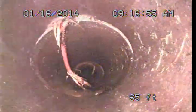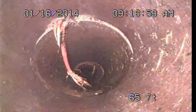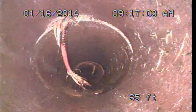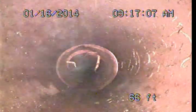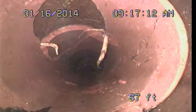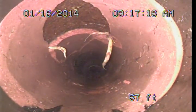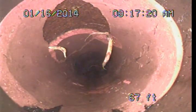We are seeing some remnant roots left, some that were fairly large in diameter, like this one here. It is not all that uncommon. It looks like this area may be starting to chip away along the top of the pipe. And then up here the pipe is actually starting to break — what this is, is a hole that was in the top of the pipe.